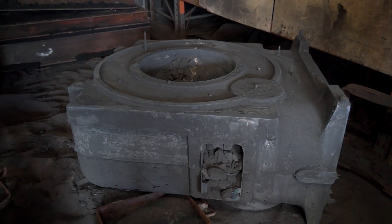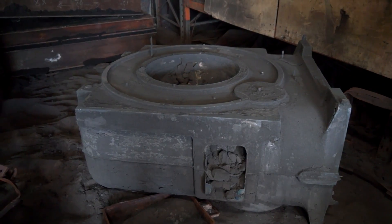After it comes out we shot blast it to remove any sand stuck to the surface, then we cut off the runners, risers, and sprues — the delivery metal — and grind back those areas before it goes to the machine shop. Sounds simple enough — how long have you been doing this? It's our 60th anniversary this year; the foundry was formed in 1958. Castings 101 — fantastic journey, thank you very much. You're welcome, glad to see you.